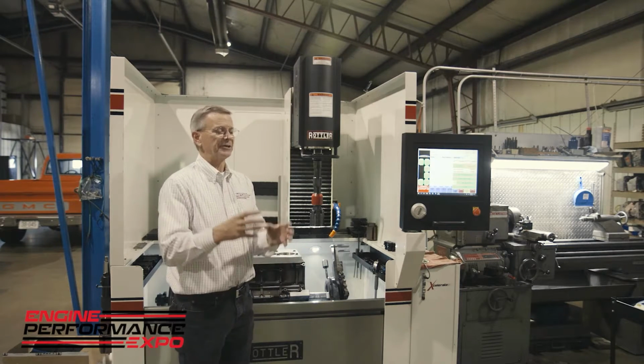It will matter a small amount. But with diamonds, the diamonds are in what we call a metal matrix, or a metal bond, for lack of a better term, that the diamonds are actually held in place with. And you can only have so much penetration on the diamond. The diamond is so big, and so much pressure penetrates the diamond into the cylinder wall, and then you get that metal matrix. And so it's not going to go any further by upping your pressures.